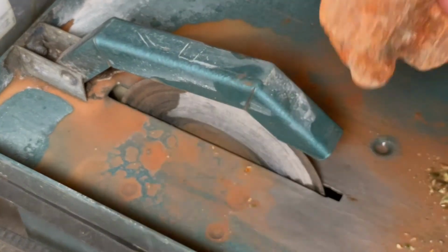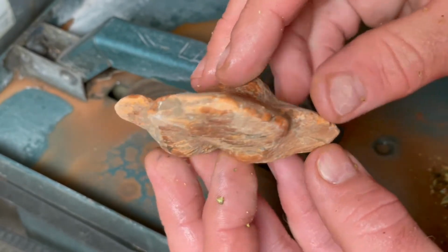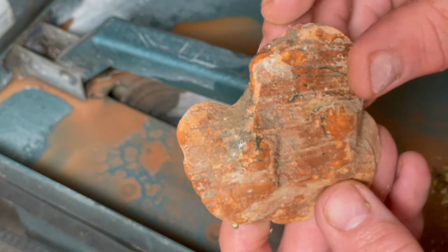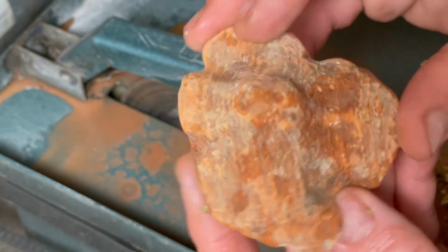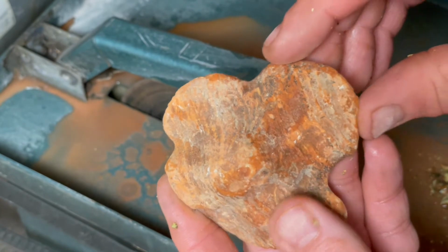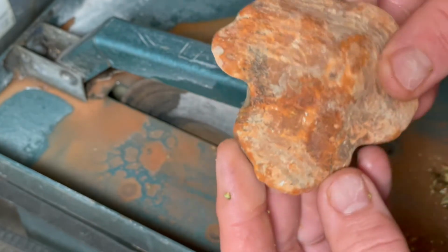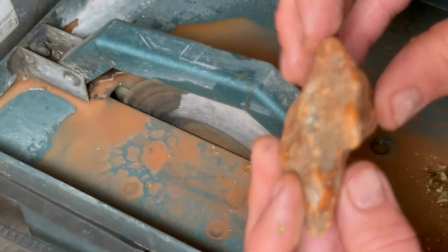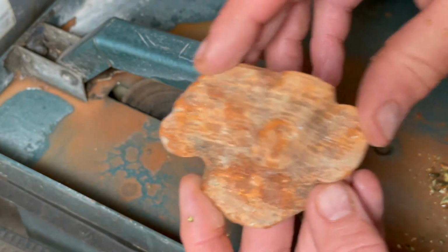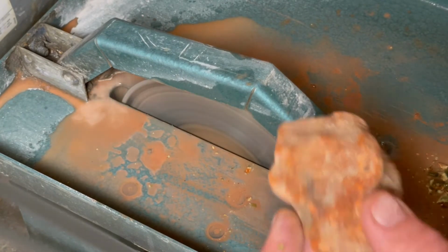I add a little bit more water. Again, this is kind of like a biscuit if you've ever cut the Woodward Ranch plume agates. So we're hoping we got no windows on this, so this could just be totally junk chalk. We'll see how it actually cuts. It does have a wider diameter than my kerf of my blade that reaches above the table, so as I cut, I will have to pull it out after a cut and flip it around to do another cut to get the full length. Again, we're going to go as close to that axis as possible, and hope we get real lucky. It's fine to use a little extra water in this case, so if it starts spraying everywhere, nope, we're good.